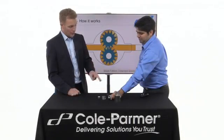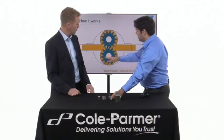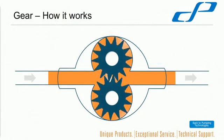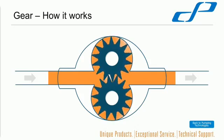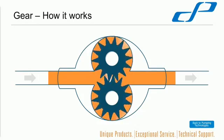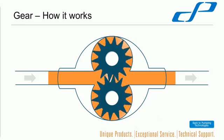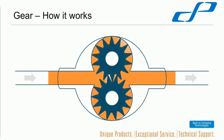Is there anything else that the gear system will do in the pump? It's important to realise that the liquid itself that is being pumped lubricates the surface of the gears. This is especially important as the gears run quite quickly. Without this lubrication, they can actually get very hot and burn up, and you end up needing to replace your gears. So we say we cannot run these pumps dry.